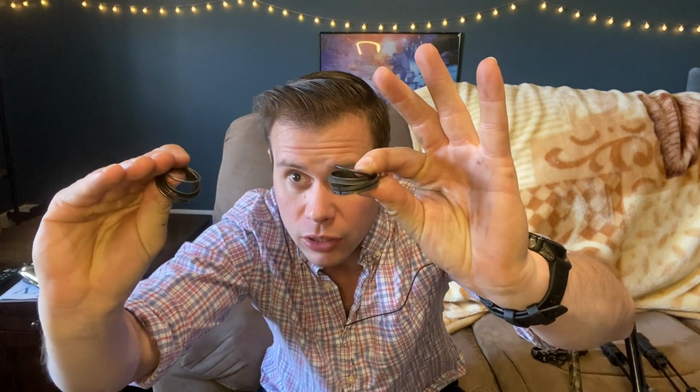The 1187 was built from the get-go to run on both 3-inch and 2 3/4 inch shells through the miracle of some self-adjusting gas system that it utilizes. However, if you look at the pieces and parts of the gas system, you'll see that there's not a whole lot of difference. These are the same pieces, which, holding them up next to each other, I can tell no actual difference between them.